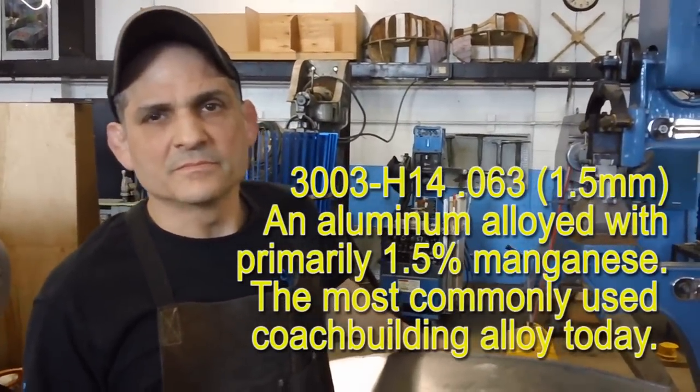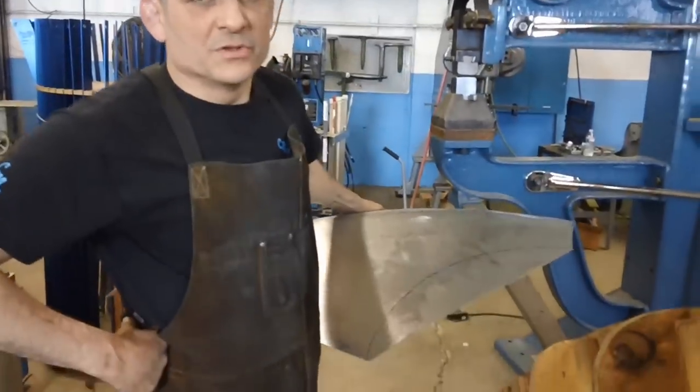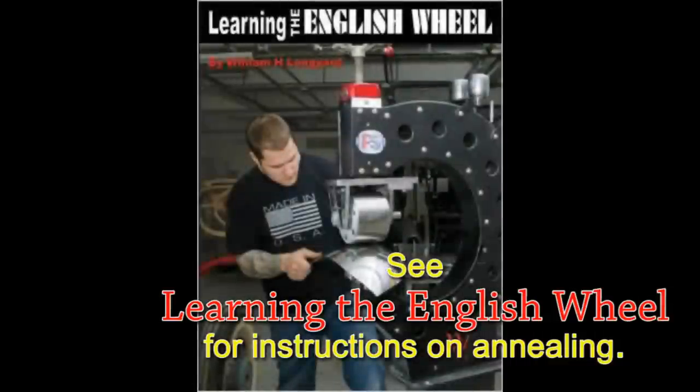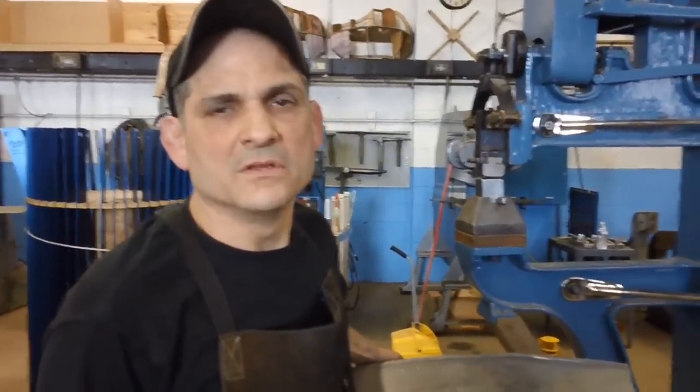So you're going to anneal it now? Yeah. How do you know at what point you want to anneal it? Well, some guys will do the soot test with a torch and soot. I use a piece of hardwood and I'll torch it, and when the hardwood starts cooking, I know I got it. But at what point do you know that it needs annealing?